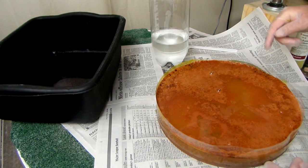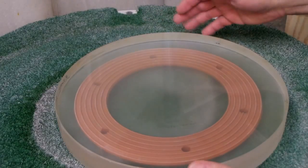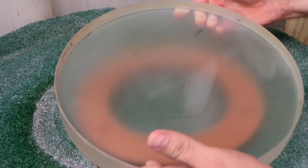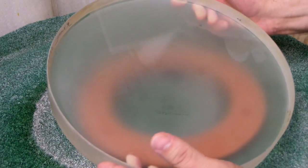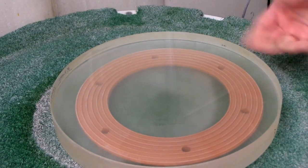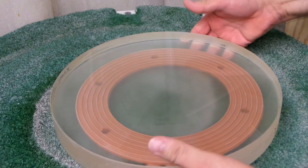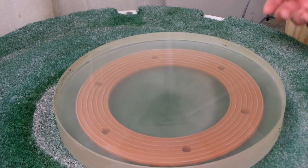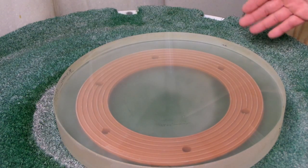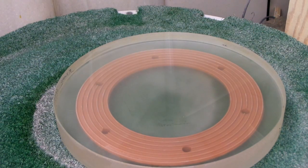Here's the mirror — it's been stripped of the aluminum, clear and ready to go for refiguring. So it's an easy process. Took about two hours to strip this time, though I often let it go overnight. Use the ferric chloride in the Etch-It solution — about $12 for a 16-ounce bottle — and you can use it over and over again. It's quick, it's easy, it's not dangerous, just a little messy. Put some newspapers down and you'll be fine. Thanks a lot.